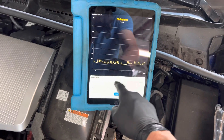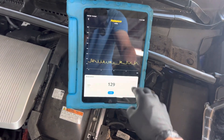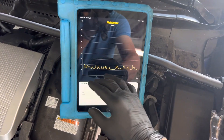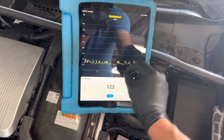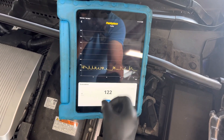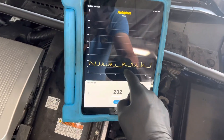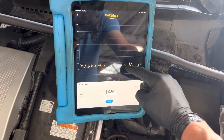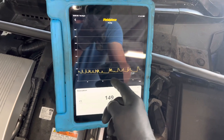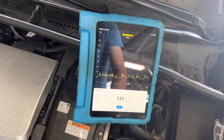You can actually see that with your eyes, and a good micron meter will actually read it. What will happen over a period of time is these little jumps you see will start to disappear — they'll become smaller and smaller, and the intervals between every little peak of boil-out will become longer and longer. Till eventually, after a period of time depending on how much moisture contamination there is, you'll see it almost flatline — basically just a dead person's heartbeat instead of somebody having a bad heart problem. Eventually you'll have a flatline, and then you know you've removed most of the moisture.